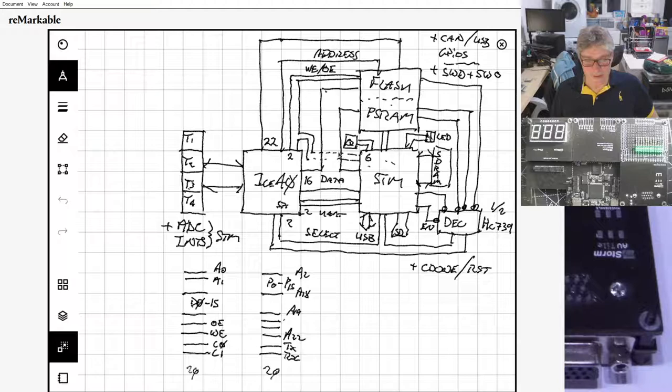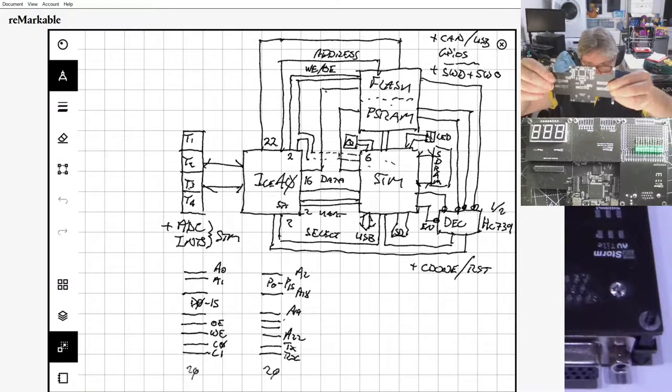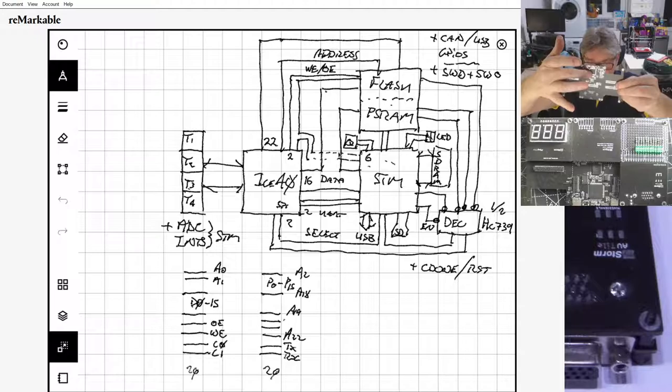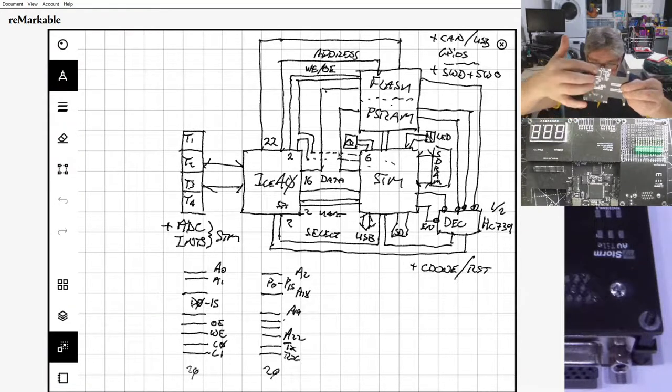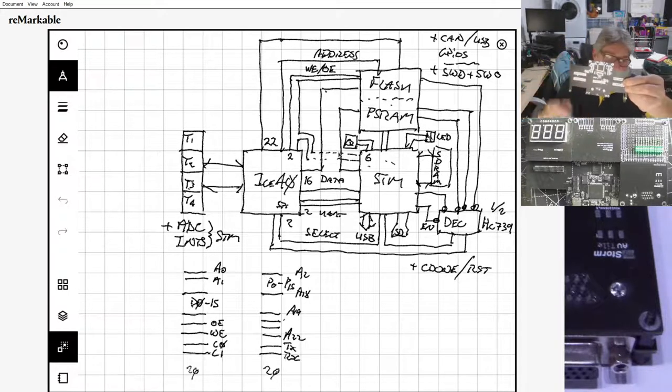So we have this kind of constraint on some of the pins that means they're immovable, if you like. We can't mess with those. That in turn gives us another problem, because when we have this board like this, where we have the mezzanine at this side and then the extra tile this side, and we want pins from both sides, they're split either side of the FPGA in a way that makes it inconvenient to use both of them or exchange the use of them.